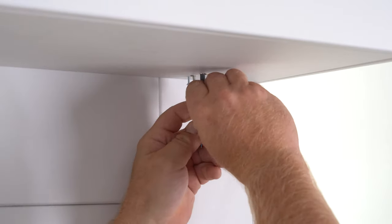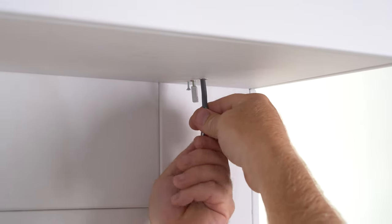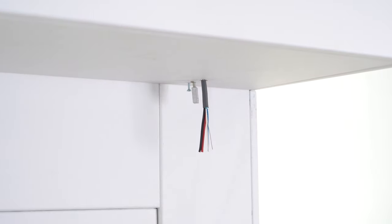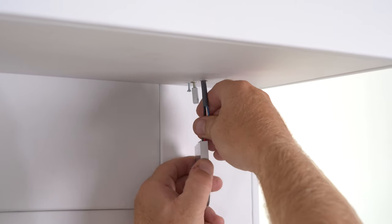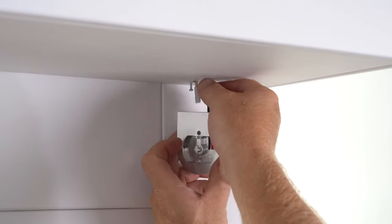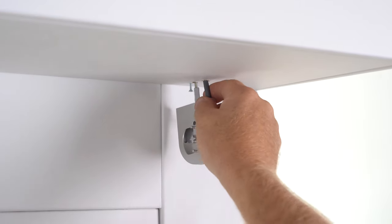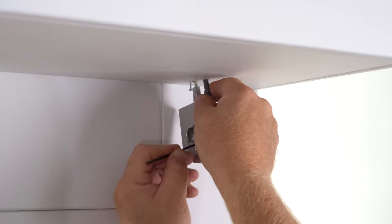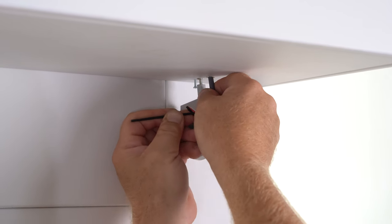After we remove our aluminum shield, we can take all of the wires and just bunch them up so that they'll fit inside of the wire way on the drive side bracket. Get them all to come through. And this is where a little help from my good buddy, the Allen wrench, can help out, just to pick them out of place so that they don't want to stay seated in there.